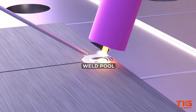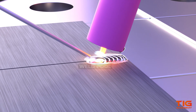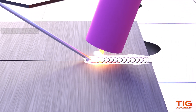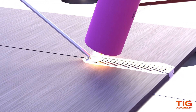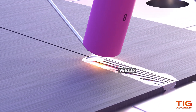When the tungsten is slowly being moved from one side to the other, you can see the weld pool moving along. Additional metal, called filler metal, is often added to build up the weld to make it stronger. As you're moving along, the melted metal right next to the weld pool starts cooling down and solidifies. That is how the weld starts to form.